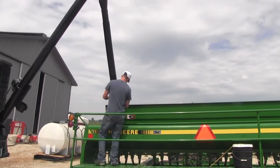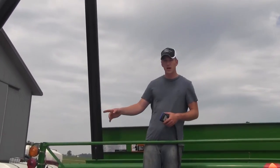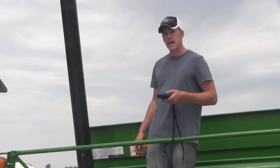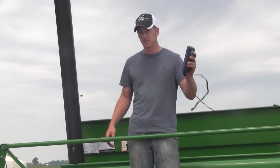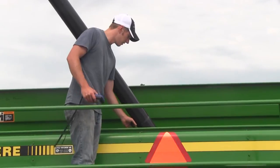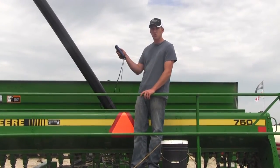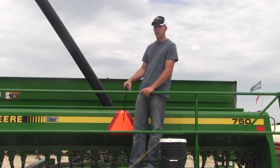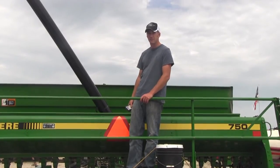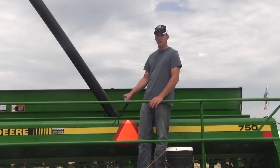We'll go back to our first box and set that in there. What I can do is either program into my scales the weight I want to go into this box, or I can just hit auto on my remote and it will auger into that box until I tell it to stop. I can just go down this whole drill and do all of it without leaving this platform. I've got my drill boxes loaded, everything's open, and it's all done with this remote — I can start it and stop it with the push of a button. In a few simple minutes I can have this drill loaded and be back in the field planting. That is an overview of how the Truag Defender Seed Caddy works to easily fill your grain drills.